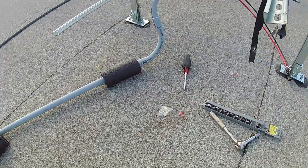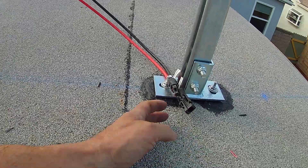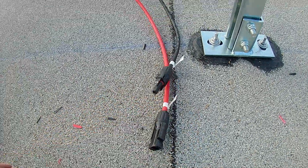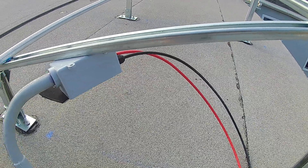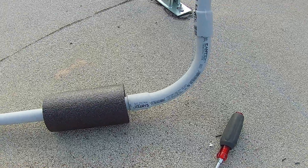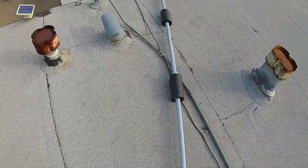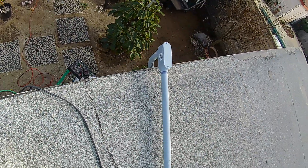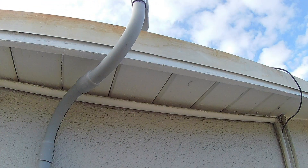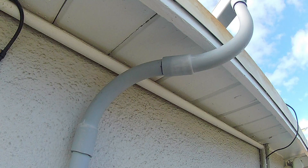I've completed the bulk of the wiring. What I have is a PV wire terminated with PV connectors that goes into this box. I had a fairly long length of PV cable so I pulled it all through. I have it running through a 3/4 inch PVC conduit across the roof and into this LB box, and then down. From below, this is what it looks like — the LB box comes down through a couple of 90 degree bends and into this box.